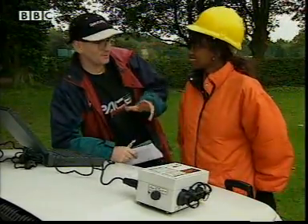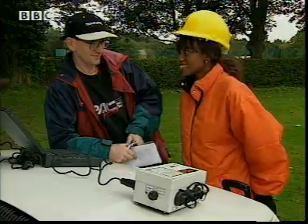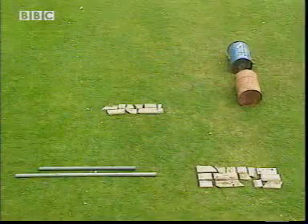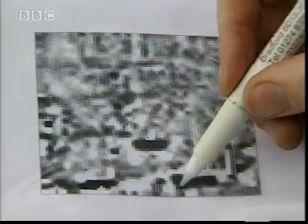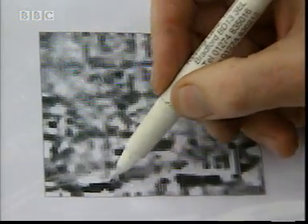Sullivan, Fenny, when we put your results into the computer, what does the printout say? You haven't done too badly. Look — the white areas are low resistance, so here we have the metal drum here and here. And the dark areas are high resistance, so we have the concrete here, here, and also the pipe coming in here.